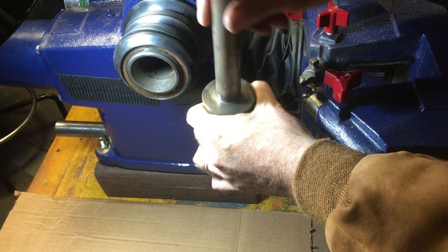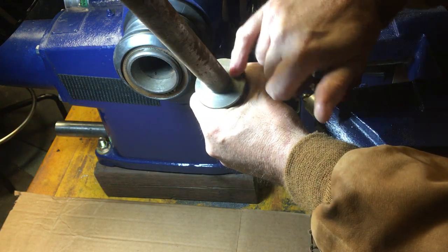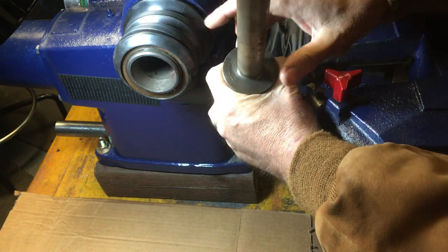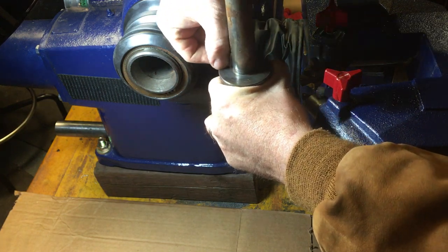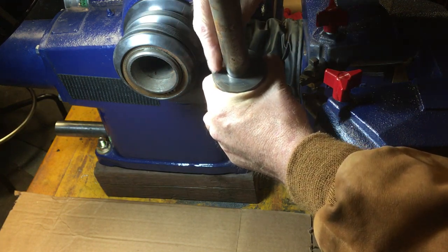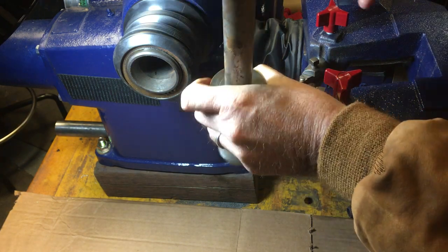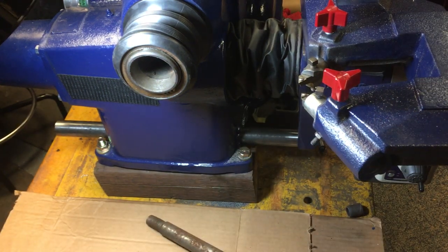I don't know if you can see that in the picture, but there's grooves around here and stuff. Okay, this one's not that bad, but a lot of them are much worse. If you look, there's a goober right there. That's not good. On a small rotor, this stuff wouldn't matter. On a big rotor, it does matter. So we're gonna start off by lapping in the arbor.